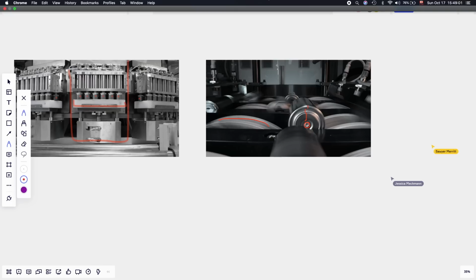And this is where you end up with a finished cell, which is ready for the next step, which is basically formation. This is where you charge the cell for the first time and you age it at high temperature, at room temperature. And these formation processes are basically there to grow imperfections.